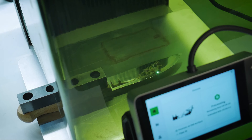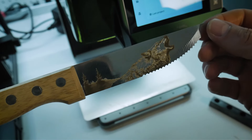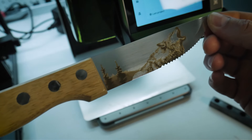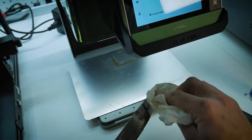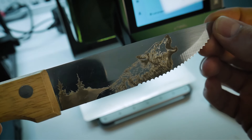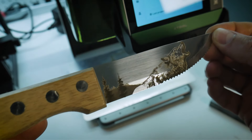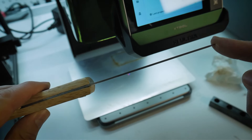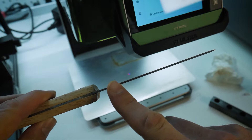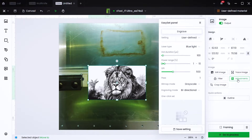Based on previous results from the other stainless steels, I doubt the 420 series is going to look any different, since all IR laser results were very consistent. After finishing and cleaning the design with isopropyl alcohol, it looks even cleaner and sharper with more visible detail. Although it looks very nice, my concern is that in the long run, this may cause the blade to start rusting. Let me know what you think in the comments below. One good thing with the IR laser is that it doesn't pump enough heat into the material to warp the blade — that's more of a problem with the blue laser.